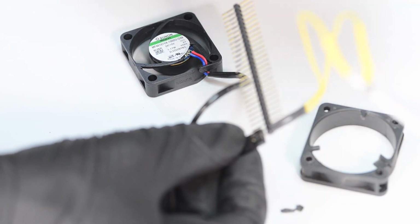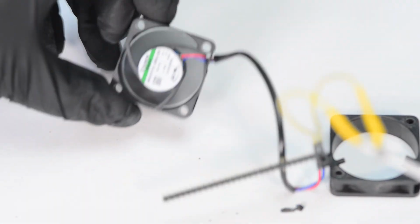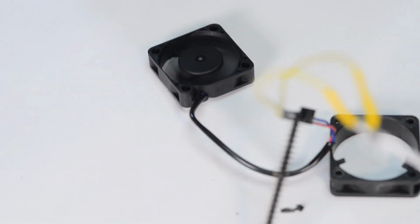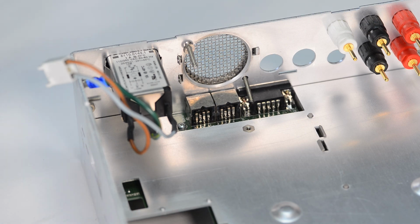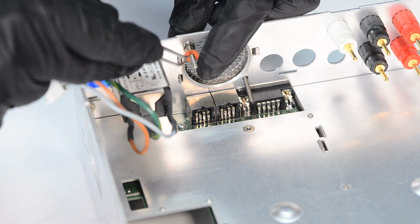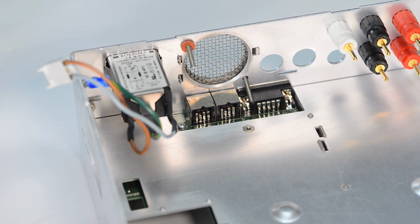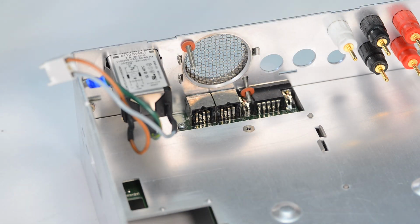And here we have a happy fan that is working normally with a new cable. The new fan is happy and taking about 65 milliamps from the same 12 volt source. To get the instrument noise a tiny bit quieter, I've added paper spacers between the fan body and the frame. Also, during normal operation, the voltage supplied to the fan is not 12 volts but actually lower, further reducing noise compared to the full nominal 100% operation per fan specifications.